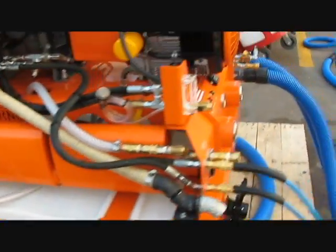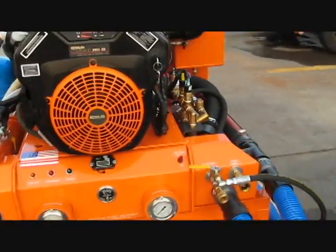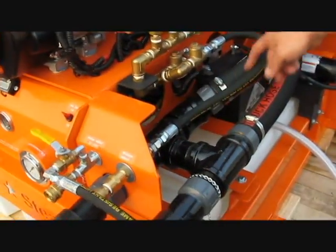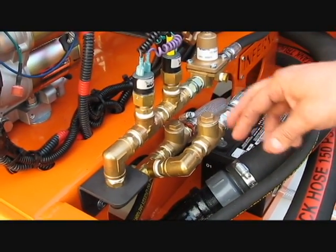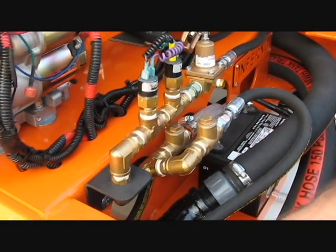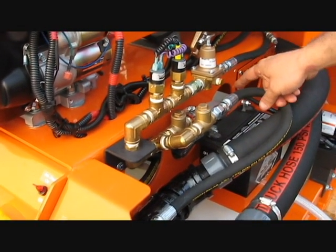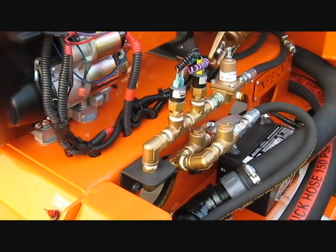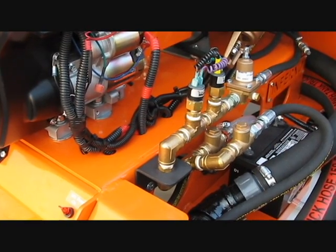As far as the plumbing system, it doesn't matter if you use the freshwater tank or the garden hose. All the water has to travel through 2 different check valves, which are set up backwards. In other words, if you give it water from the garden hose, there is no way for you to accidentally fill the tank with water or damage your 12 DC pump with back pressure, because these 2 check valves only allow one-way movement of the water.